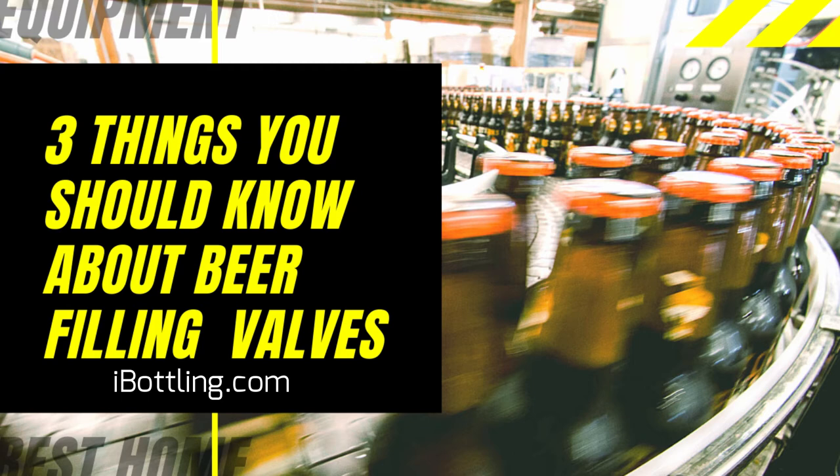The bottle holding mechanisms have three structural forms: Mechanical, Pneumatic, and Combined Mechanical and Pneumatic. The mechanical and pneumatic combined bottle holding mechanism works stably and reliably. The compressed air is circulated in the loop pipe and only needs to supplement the leakage, so it is widely used. It uses compressed air as the power source and has good shock absorption and buffering capacity. It is not easy to damage the bottle when it fails.